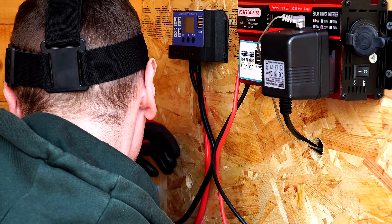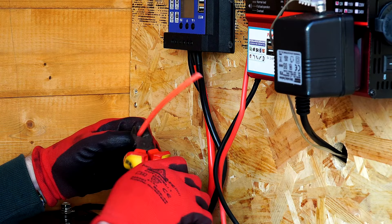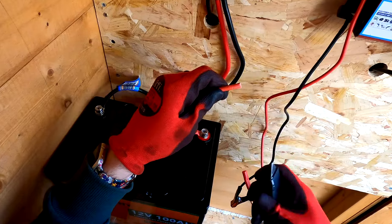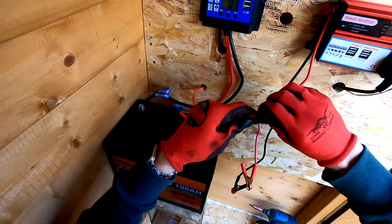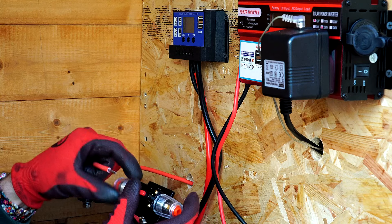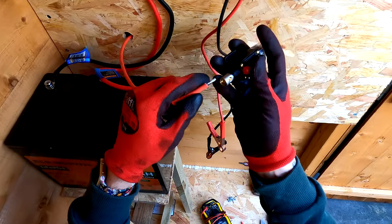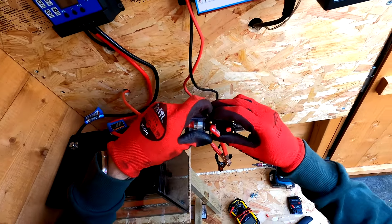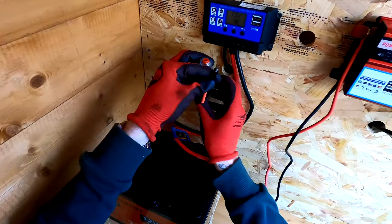Now I've unplugged the two solar panels. I disconnect the positive wire and measure it up to add a 30 amp breaker, so if there's any short circuit or if the wire overheats and the amperage gets to 30 amps, this will trip the breaker, breaking the circuit and stop the wire burning or creating a fire. My whole idea in adding in all these breakers to the positive wires is just to make this a safer setup. There are many different styles of breakers with different maximum amperage. For these 10 gauge wires with the MC4 connectors, these cables have an external coating and when stripping them it's like stripping two sets of PVC coating. Do plenty of research before creating your own setup — the length of cables and the copper core size can affect the voltage and amperage, so seek further advice.